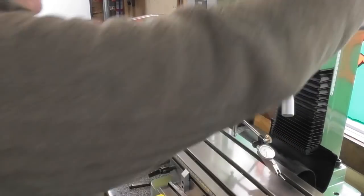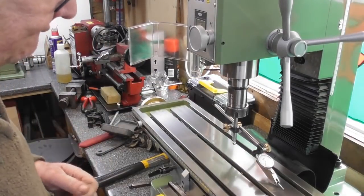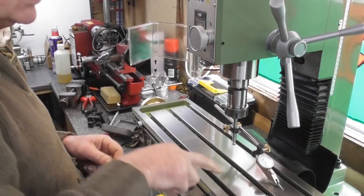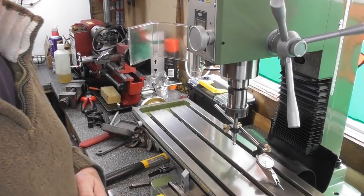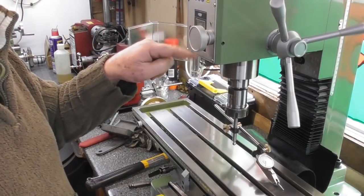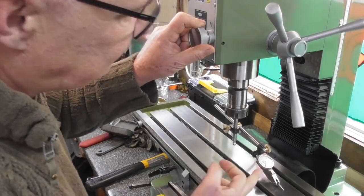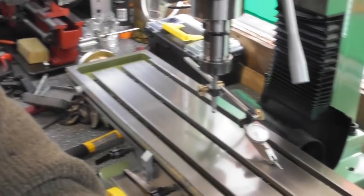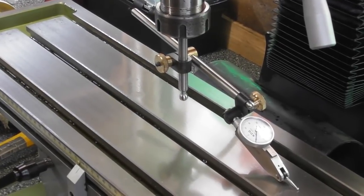Let me just bring the head down to somewhere near — we're just a couple of millimetres off. I'll lock the column. If I tighten up the screw here I can now wind the clock down. Let's go for a 0.1 touch-off — it'll probably end up being further out than that but we'll see. If I turn on the little digital scale readout and wind down to get my clock just to come up to zero...